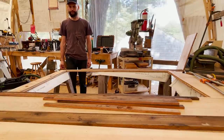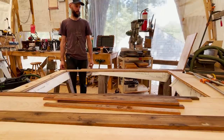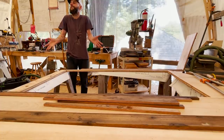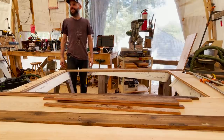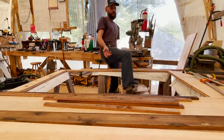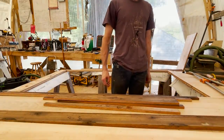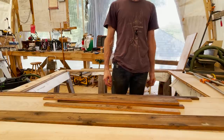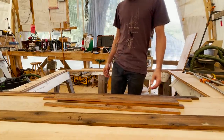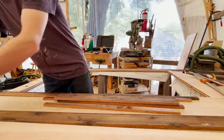I just wanted to put something along the bottom edge there to clamp to. Over there? Yeah, so you're not clamping to the bottom of the plywood. We should be all clamped to the bottom of the plywood just fine. Okay. I mean, we literally just have to get them to sit there. I know. It's just going against all the other things in my brain. Yeah. Well, it's the joy of epoxy, and it's also the joy of, this is just trim. True. If it falls off or it pulls out someday, I'll put a screw in it, or I'll smear a little more epoxy behind there and put another clamp on it. It's not like if this fails, the boat sinks. That is incredibly true and a really good perspective on things.